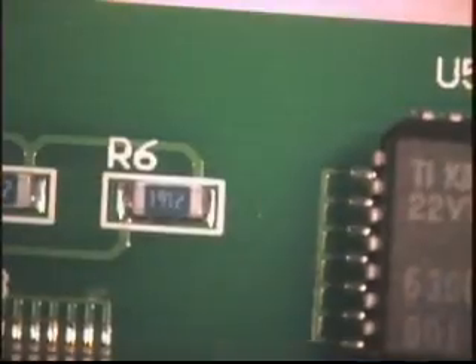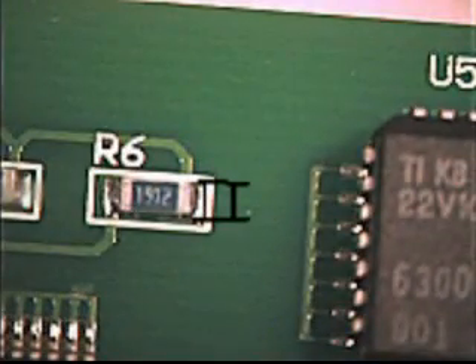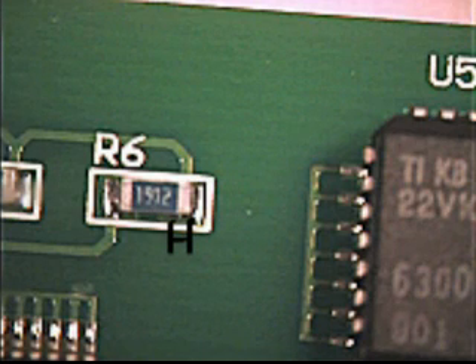The final component today is a chip component. Ensure that the solder covers 50% to 75% the width of the end of the component. Along the side of the component, ensure that solder is visible at the lower edge. Solder is not required to be on the side face of the component, as many components are not solderable in this area.